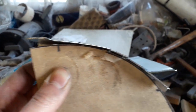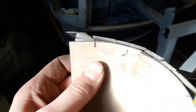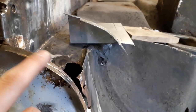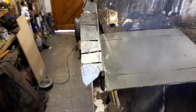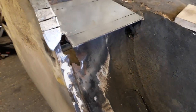The rest of the relief cuts are all pretty snug, and I know that the wooden piece I made is accurate because it fits in the gap. I'm quite happy with how that fits — obviously now I've just got to bend that bottom edge. I'll quickly show you how the wooden piece fits right in there, so I know it's pretty well as close as it's going to be. When I put this piece in, I can finish hammering that edge, do all the welds, and then trim this back because it only needs to be about 10mm wide and it's about 20mm at the moment. I'm quite happy with how that all fits in there. Now I just need to bend this lower edge and that panel is pretty much done.